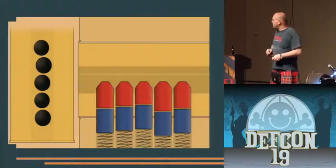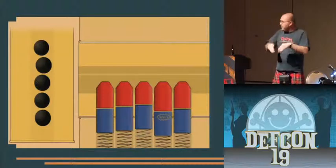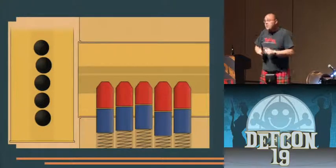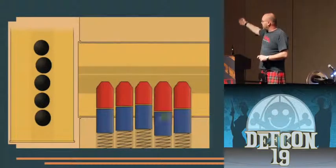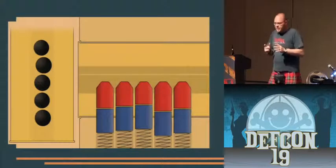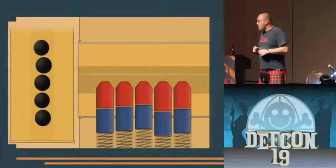So what we try to envision is, you see the five dots on the left side, that's actually up for you. So that if you turn it, not all five of these blue bits are preventing it from turning, but one of the blue bits is the first to prevent it from turning. If I would be able to take the second pin stack and put it down to the correct level, then another blue bit would be preventing it. So basically, we try to look at a five-pin lock as five locks, each containing just one pin stack.